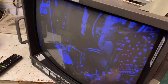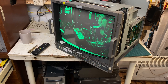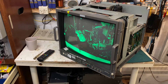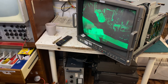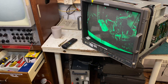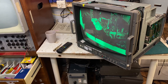The monitor basically looked like this: it was green. The whole screen was all green no matter what you did to it. It was almost as if the green gun drive was turned all the way up. This is a common fault with either two failure modes: the green cathode is shorted to the grid, or potentially the green drive transistor or transistors have gone short.